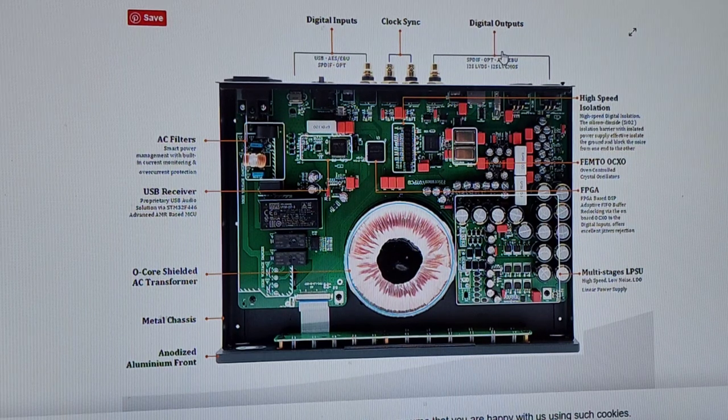So we bastardized it by using a video protocol, a balanced digital output, which is HDMI using LVDS, and we go out of here, I2S, over to the Denafrips DAC that has the USB or the HDMI I2S input, okay? You still have to use transformers on both ends to isolate the noise because you've still got a wired connection, okay? If you really wanted to be the cat's meow, the big daddy, you would have digital output via fiber optic out of this thing, okay?